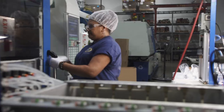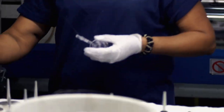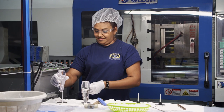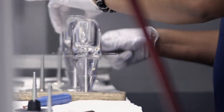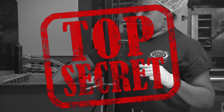The molds are then opened, but the bodies are not fully hardened. The parts are actually malleable — very bendable. You could probably flatten one very flat. The partially hardened bodies are put on a cooling fixture, and a pin is inserted into the hole to keep the shape. Those holes will actually close up on us if we don't put a pin in, and the Venturi won't work at all with closed holes. After the pins are inserted, there's an additional top-secret cooling process — about a 15-minute cooling period where we control the temperature of the parts as they cool.